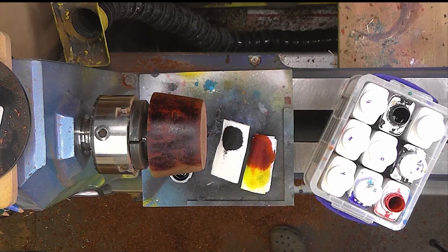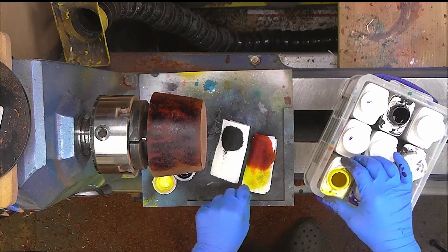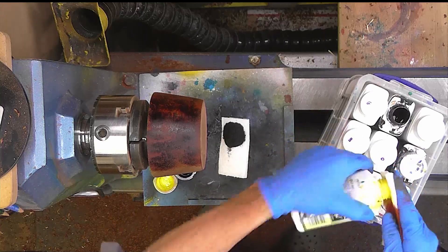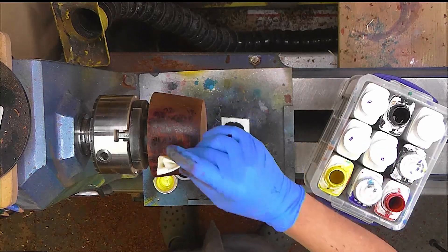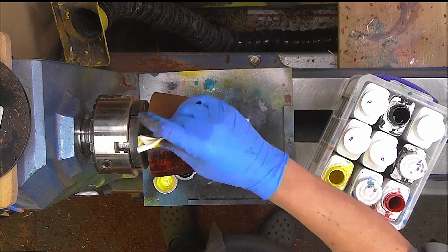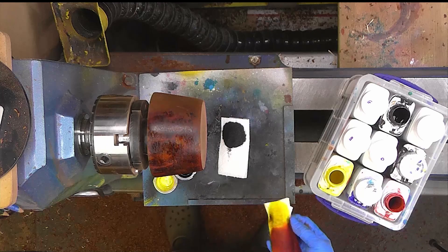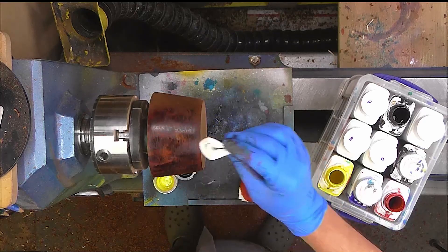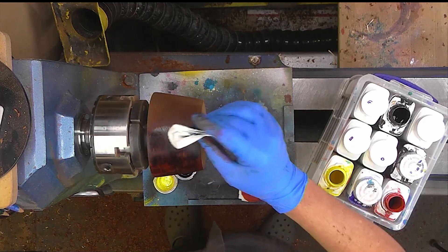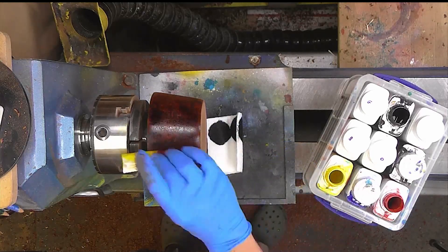Black — I would have thought it would have taken very well, which it does. A bit of yellow there to try to cut that back. Remember, the stains will start to dissolve each other. And some yellow over the black — although it might seem like it'll just get lost, it will actually have an effect on the black, as you can see there. Have I taken too much black off? Better put a bit more on. Are you listening, Roger? Right, so there we go — that's pretty much the stain done.